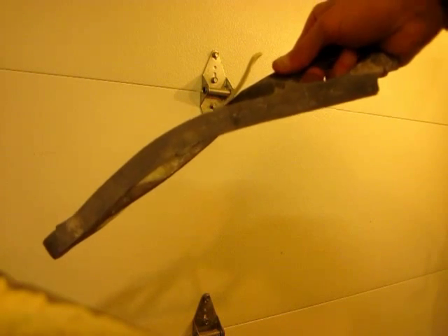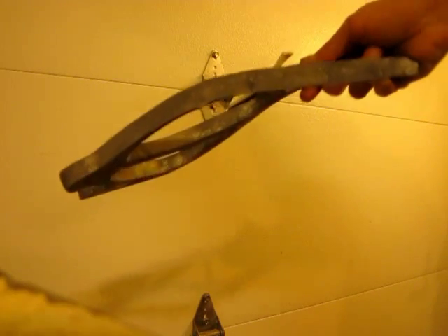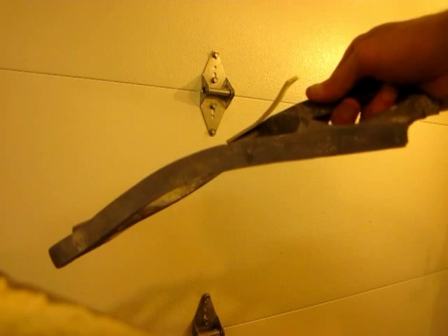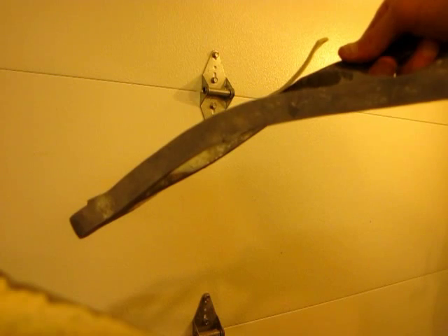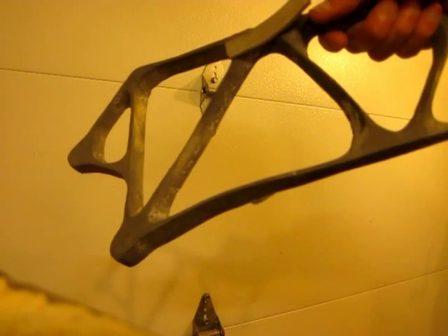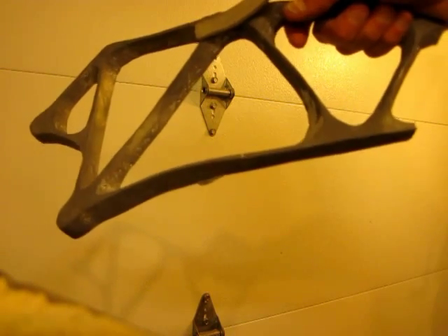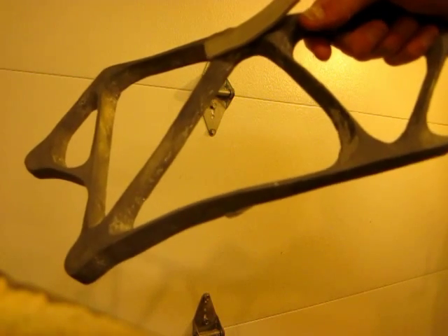Aluminum gets really soft a couple hundred degrees before the melting point, so I was really concerned about this — and for good reason, because that's what happened. I was away from the kiln for a couple of minutes and the heat got up to 1,070 degrees Fahrenheit. Prior to that it had gotten up to 1,030, and I looked at the piece after it had been at 1,030 degrees and it still had not deformed. So, if you're a nerd like me, you'll find it interesting to know that aluminum gets soft enough to bend somewhere north of 1,030 and somewhere south of 1,070.